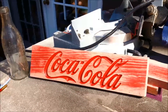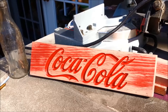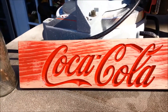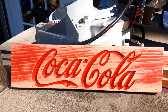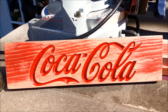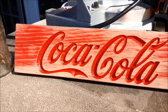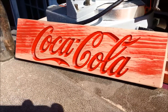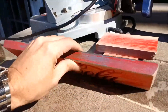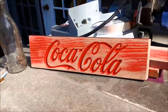That's the final result — it came out kind of neat. I ran this through Adobe Photoshop and then to F-Engrave as a bitmap, then ran the path through. It was not overly complicated. After the G-code was created, we ran that over to Mach 3 and put that through the CNC machine. This is a home-built CNC machine made with drawer slides and the registration is pretty good. There's some silver on the back, gives it an older look — kind of a rougher look, and there you go.